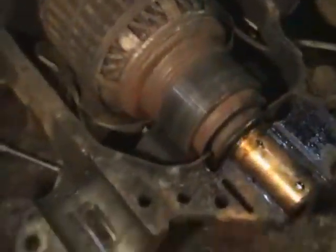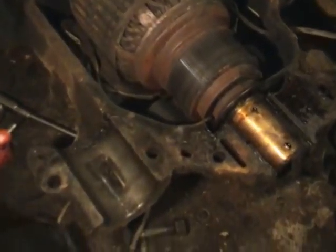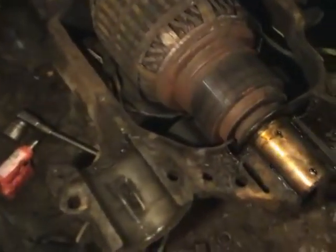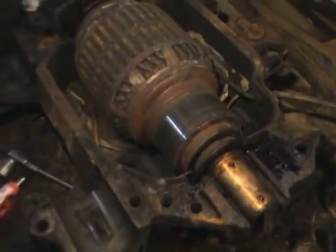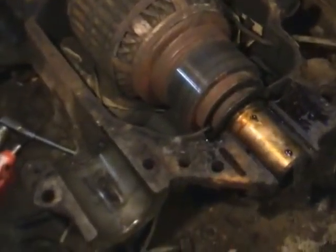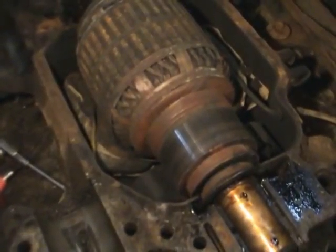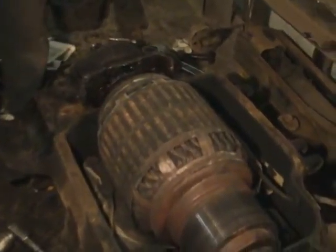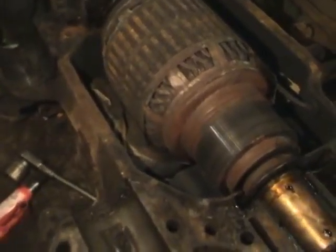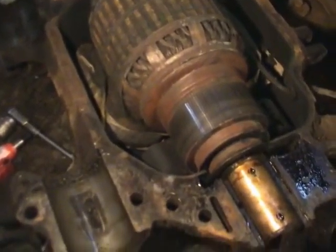So we're glad we caught this. We found this motor was extremely bad; the other one was close. We've measured two or three of them so far and they're basically all going to have to be rebabbited. We just had a man from the AC Electric Company here and he gave us some ideas as to what we would do. There's a company down in Georgetown, Massachusetts that will rebabbit these bearings and hopefully it'll be at a reasonable cost.